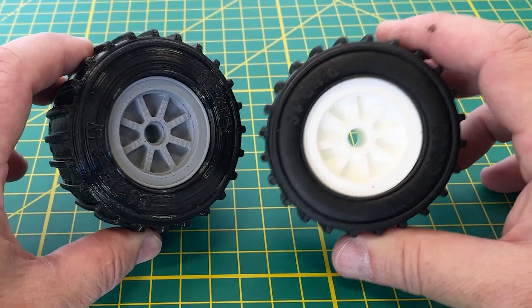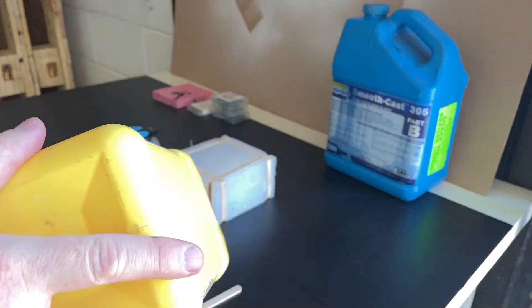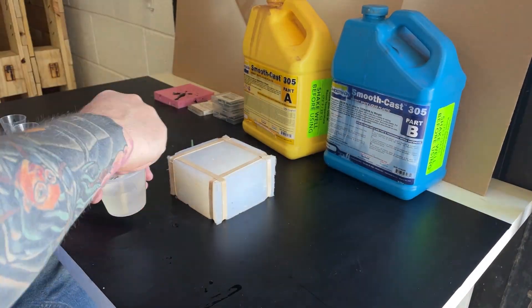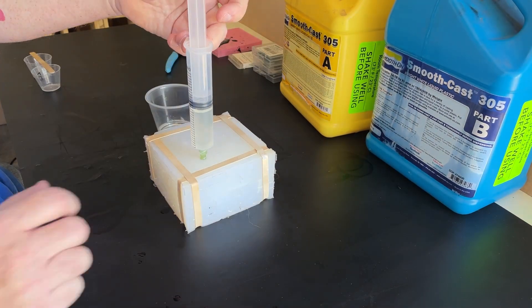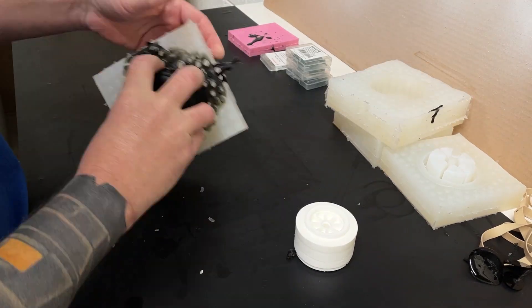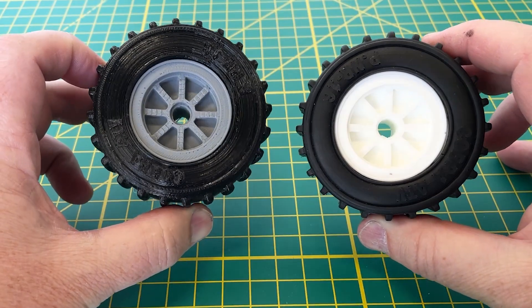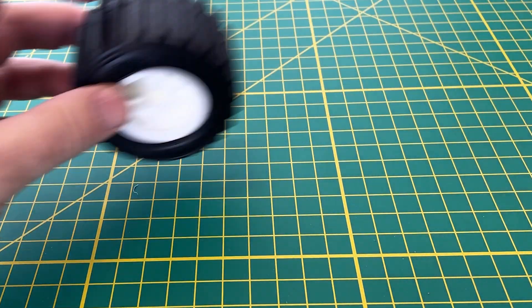For the wheeler hub, I was able to get great results with FDM, but the DLP was still better. These are large, heavy prints and a little tough on my Elegoo Saturn, especially the FEP, because it creates so much suction. I used what I had left of the Mold Star 20 and cast the hub out of Smooth Cast 305 — a bright white liquid plastic with a pot life of seven minutes that cures in 30. There's nothing quite as satisfying as cracking open the molds and pulling out a good cast. The hub just needs to get painted but it looks great. You can really see — and even hear — the difference between the FDM printed tires and the cast tires. In part three of building the ferret, I'll be painting the project.